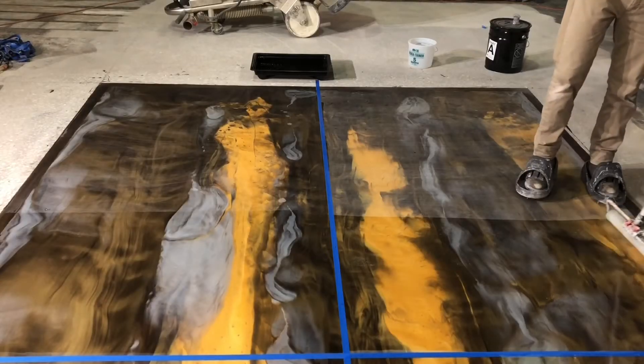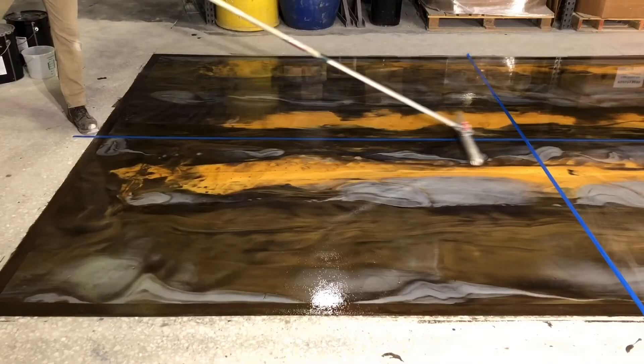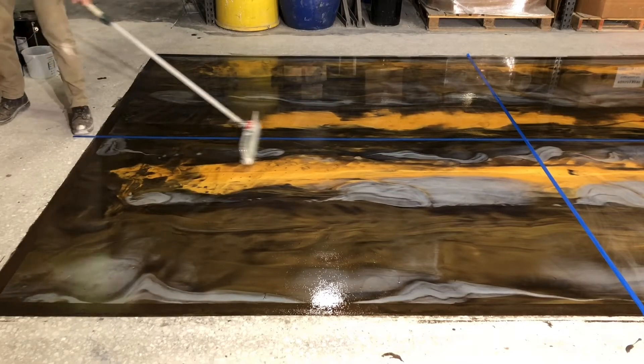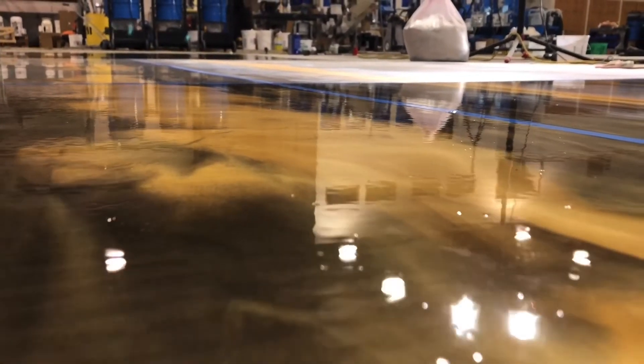The last coating tested was a polyaspartic, also applied over half the floor that had been coated with the polyacrylic sealer and the other half directly over the sanded and solvent-wiped epoxy metallic. It was easy to dip and roll, receiving two coats within 24 hours to maintain the recoat window. Once cured, the shine and clarity are quite good — almost similar to the solvent-based urethane — but looking closely, the material actually orange peels, giving a slightly rippled surface profile.